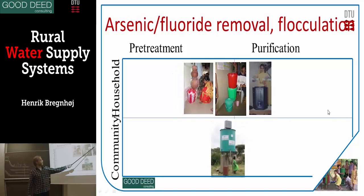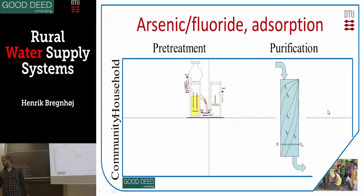You can see here: you add the coagulant, and you may need to add some base to change the pH. This is one we made — some students made it in West Bengal for arsenic. They mix it in a container, then filter it through sand in a plastic bucket or sand in a clay pot. This is a fluoride method: pour it in, stir it, sediment it, and you get clean water. This big plant here shows the same principle — flocculation.